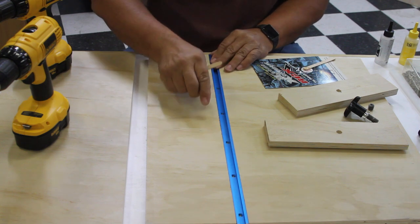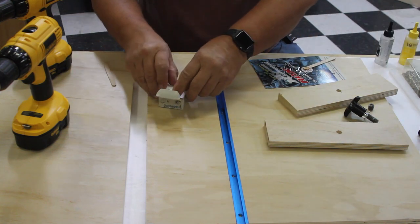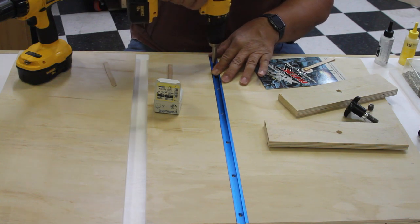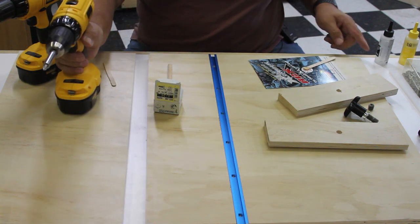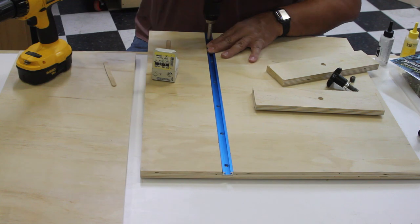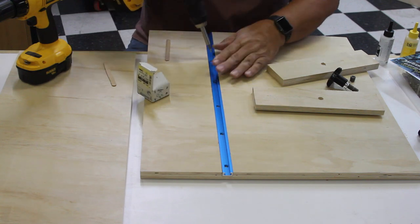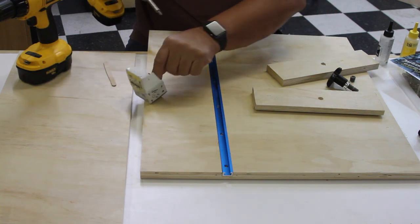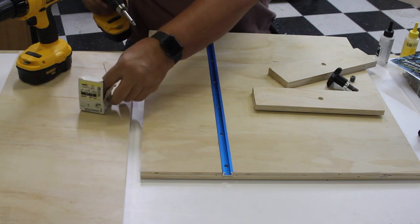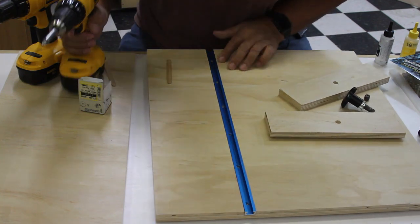I place the t-track back in there and move it back and forth a little bit to make sure it's flush. Now I'm going to take my newly purchased very short screws and screw them in. I want to make sure I'm not protruding through in any way. It's easy to strip these screws out because they don't have much to grab onto, so I just want to make contact — just snug everything down tight and make sure nothing is popping through on the bottom.